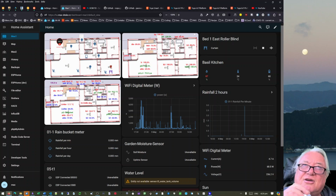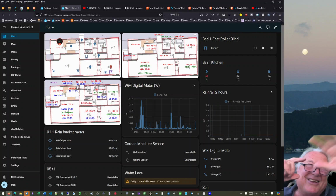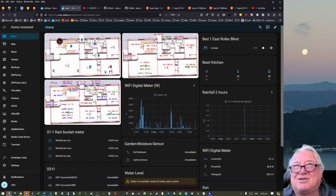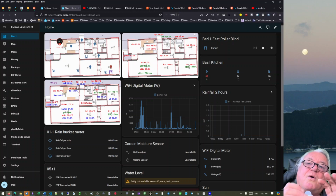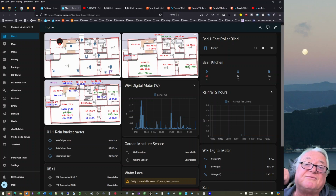Now, normally if you've got a corridor or something like that, you'd have maybe 100 to 200 lux. You just need to see that you're not going to trip over anything, as you're moving down the corridor, and you can have a low level of light. There's not generally going to be obstacles down there, but you can discern that. But if you're writing and working on a work table, you usually want about 500 lux. So you can say, I can set it to 150 lux. So if the light is below 150 lux, turn the lights on.